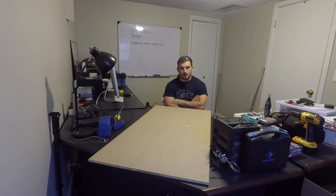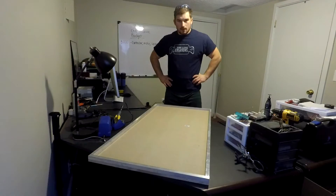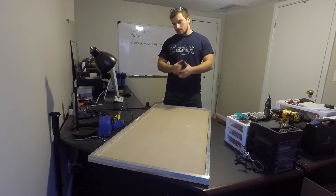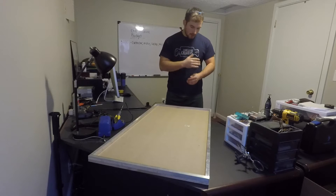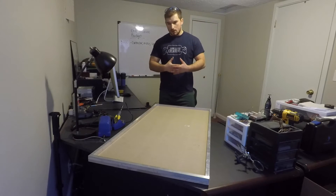To start, I went to Home Depot to get the easiest parts I could find. I got a 2-foot by 4-foot by half-inch MDF board — this is going to be the base of the CNC machine. I like that it's really big. I went half inch because three-quarter felt like overkill. Now I'm adding square aluminum tubing all around the edges to give it structural support. As you saw in the time-lapse, I marked it out and cut it on my chop saw to get nice 90-degree angles. It fits pretty well.